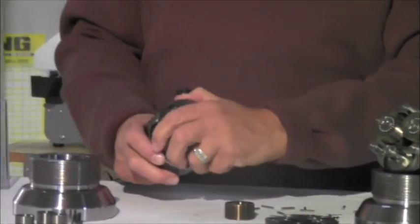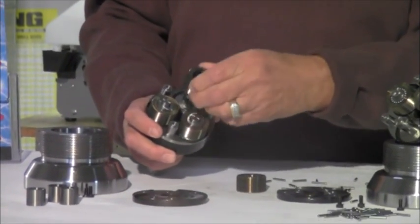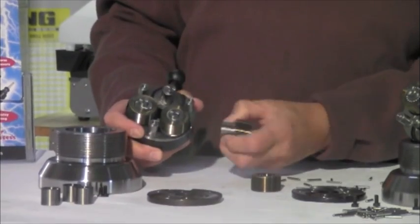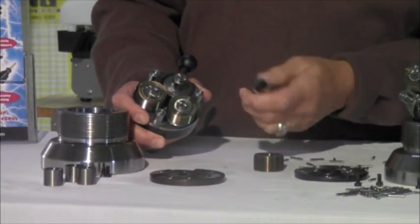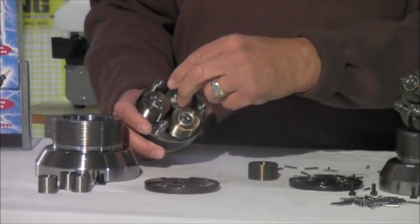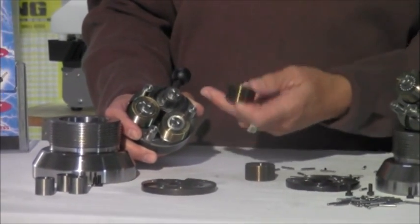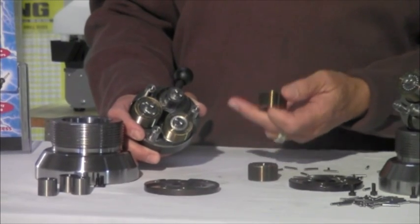The second axial thread rolling head I've assembled with carbide bushings. The carbide bushings fit between the thread rolls and eccentric spindles just like the needle roller bearings, but they're very easy to change when you want to flip and change your thread rolls from one size to another.